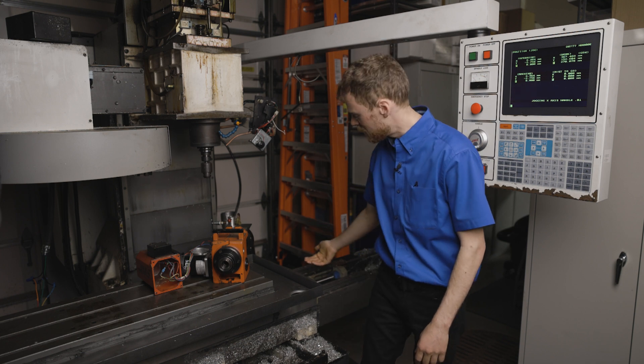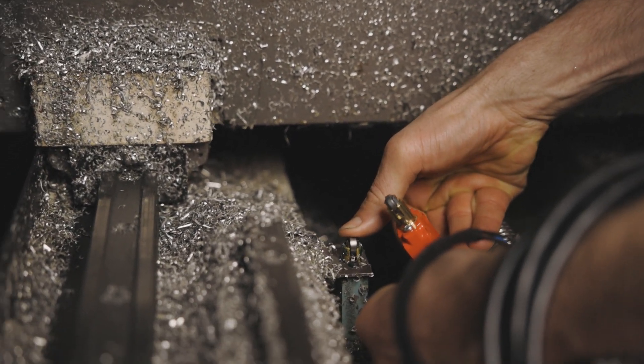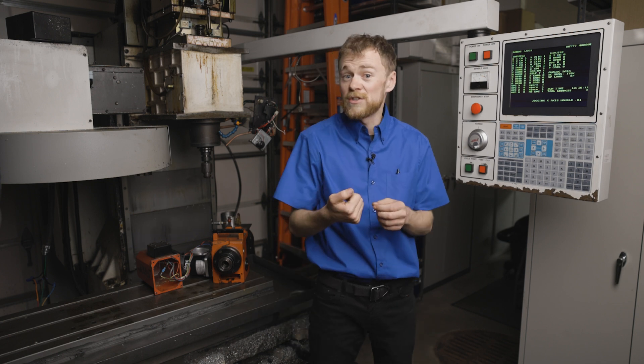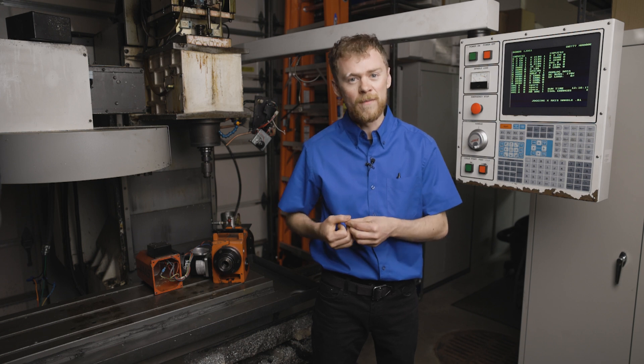At that point, climb underneath or reach in and try to push the home switch up and down. Do that while looking at the diagnostics page to see if the home bit for the x-switch is moving. Usually the switch is sticky, has some gunk on it, or a chip, and that may be why it's not homing.